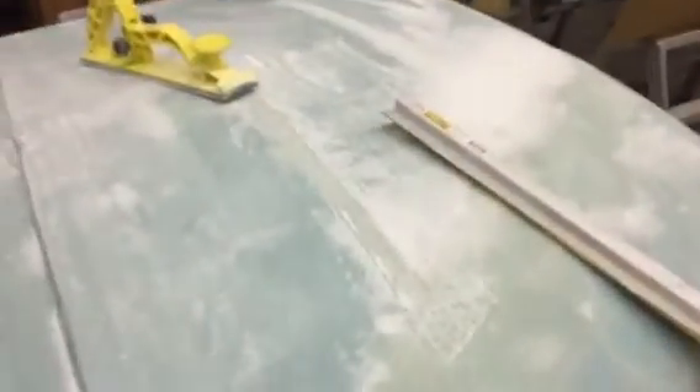We also have these tracks, which are the result of what you might have seen in the blue foam itself — a white and blue stripe pattern that is just the blowing agent of the foam. Low-cost dock blocks are what we're using for the form, and the difference in hardness is captured in a difference in machinability. Some of the softer material tends to tear away — there's a difference in cell size and hardness — and consequently where those stripes are will reveal a contour difference. It looks terrible, but our machine is accurate and repeatable to less than half a thousandth of an inch; it was precisely machined to the geometry we have. Then five layers of glass are put on, it's infused, and that's when things get a little interesting.